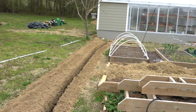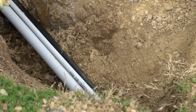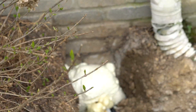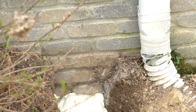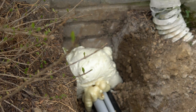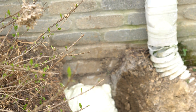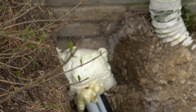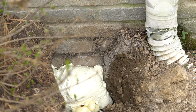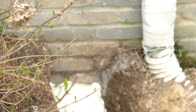You can see there's the greenhouse, and we ran the trench all the way up to the foundation. We went between the foundation and the first layer of brick, and we had to use something like a hammer drill to get through the concrete block and the brick to get under the house so that we'd be able to connect the wiring under the house.